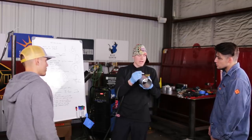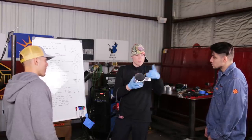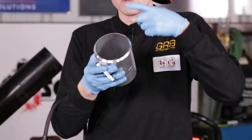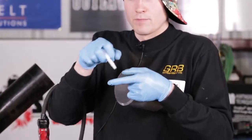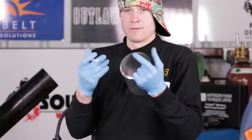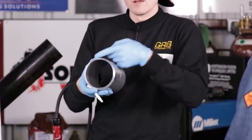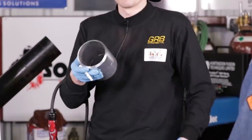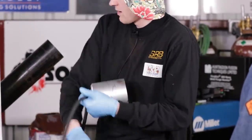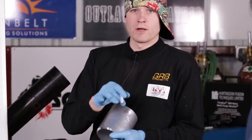And when it comes to adding filler metal, you're going to be doing an up and downward motion. So you're on the leading edge or in the middle of the puddle, but it's always an up and down motion, and that way you're always protected within the shielding gas, within the atmosphere of the ceramic cup. Some guys, you can watch them, they may pull away rather than up and down. They're removing the tip of the filler metal away from the shielding gas of the ceramic cup. So it oxidizes the tip of the filler metal, and then you're reintroducing oxides into your weld puddle.